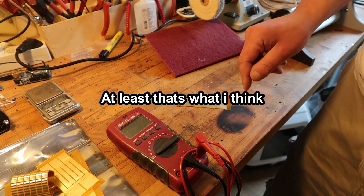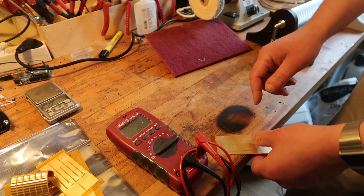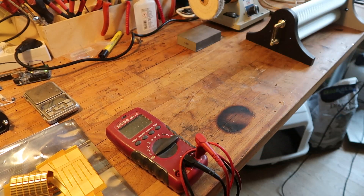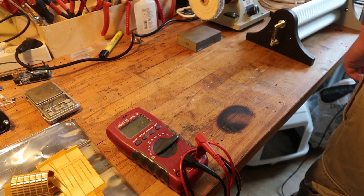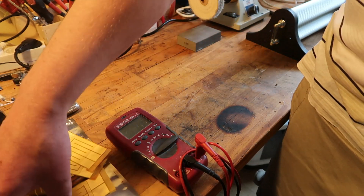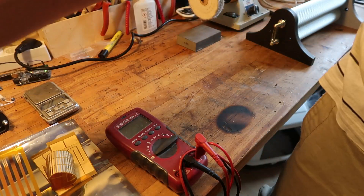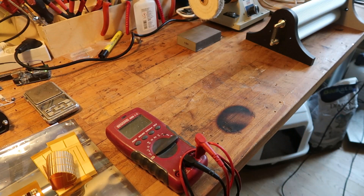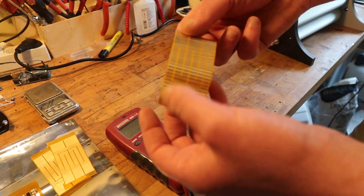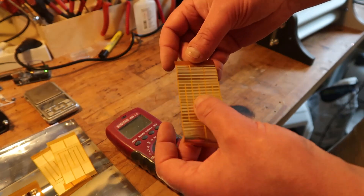They must love this design, because it will cost them far more gold plating than usual — I bet they're not liking this at all, because I don't think it's taken into account when the price is made. I have to ask if these were more expensive. I didn't know they plated everything. I was afraid that if you remove the solder mask on both sides, corrosion might be a problem. But if it's gold plated like this, corrosion should not be any problem.